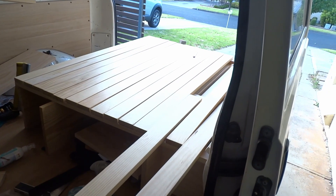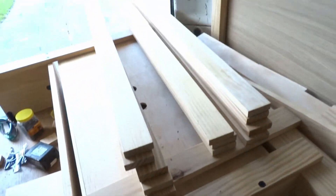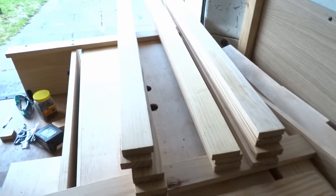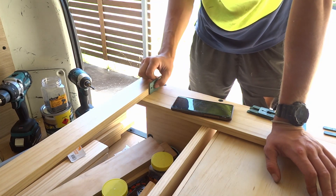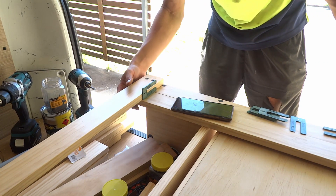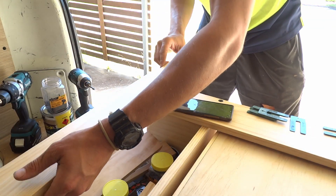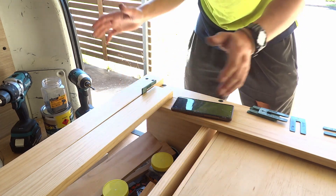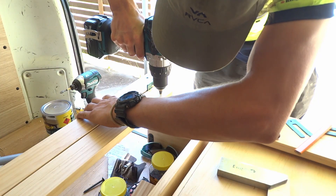I'll fix it off and build this other little section once that's done. Got that other little joiner support piece ready now. I'm going to start setting these out and stick down all the ones that are going to be sliding. I've measured the distance and worked out how much I need the gaps to be, using a series of packers — in this case 3.2mm. I'll use these packers on both sides before screwing off to keep my gaps even, so when you look at the whole thing there won't be any big jumps between spacings.